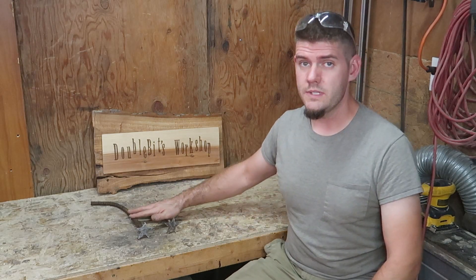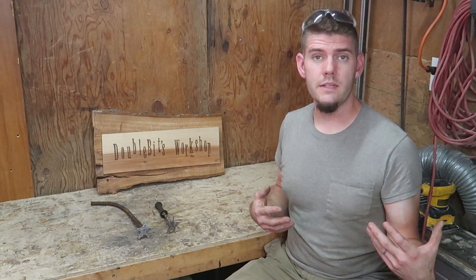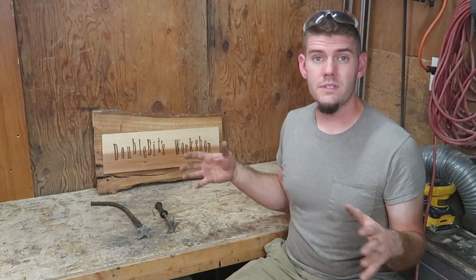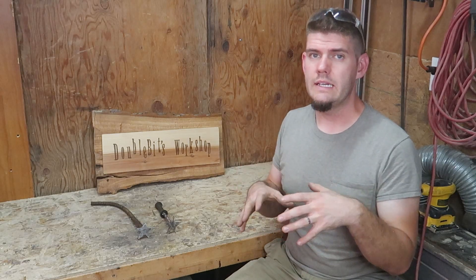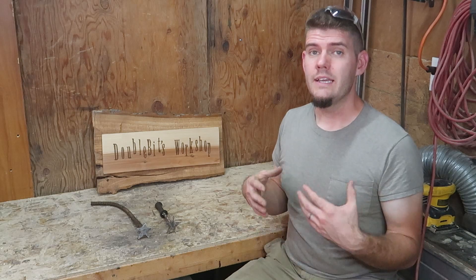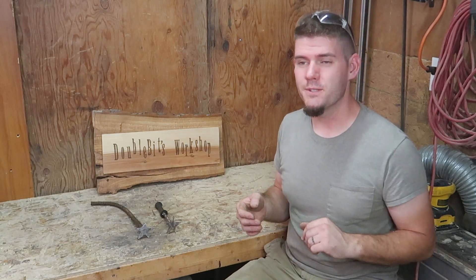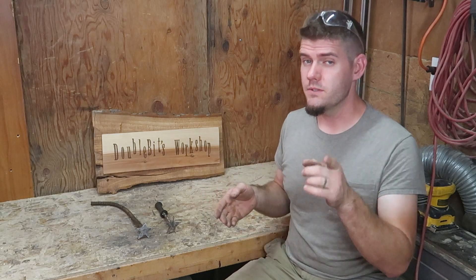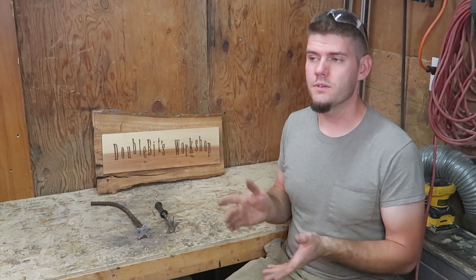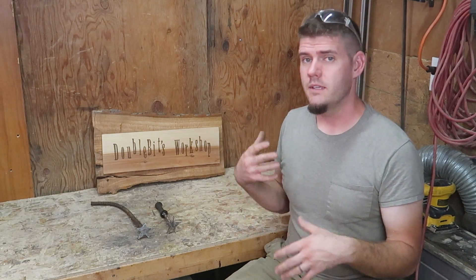Next in this process, now that you've seen how I made these, we'll continue with taking apart the pallet. I'm going to pull the boards, cut the ends, shorten them, make my distance the way I want it, lay out the boards, and do a light sanding. Because if you leave them very raw and try to burnish on top of that, a lot of the little fibers sticking up will burn down and you'll start to scorch the top unevenly, getting some charring that throws you off. If you do a light sand before you burnish, you get a lot better control over the burnishing — sometimes called shou sugi ban. You'll get different gradients a lot more easily with more control if you sand beforehand. I'll take the pallet apart first, and then we'll clip over to that next.